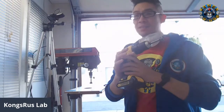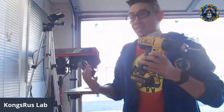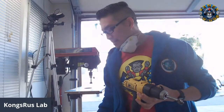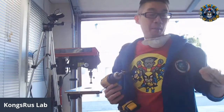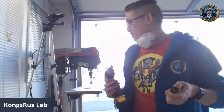And then, as I got tired and I ran out of batteries, I had my spare battery charging right here, and I would be constantly swapping these two. Taking a break, my drill would get super hot too. The bit is super hot to go through, so I would even have to cool this down. Even my bits would get so hot, I would have a bucket of water next to me just to cool down the bit part so I wasn't burning my wood.